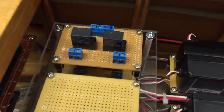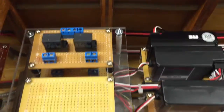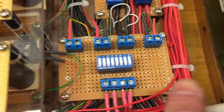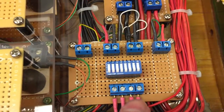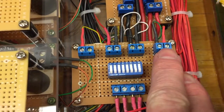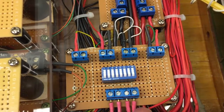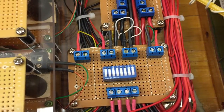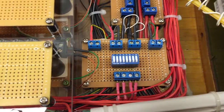Let me talk about this real quick. Each relay turns a function on and off — your power comes in and then your power comes out. What you could also do — I have four power feeds coming in here, so each one of these feeds would be coming from a relay. What is neat about this is one feed coming in goes through two micro switches and then it feeds out. So for instance, on the radio I could turn on my radars, which would be one of these coming in, and in each radar I could come in here and manually turn it on or off. It's a bit of an overkill, but it's neat to be able to show that kind of stuff.